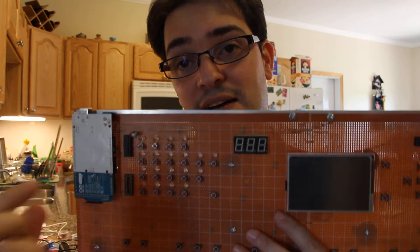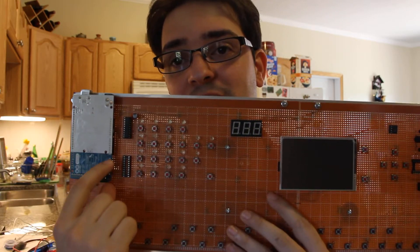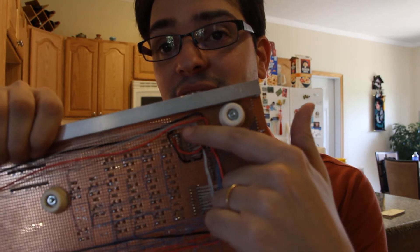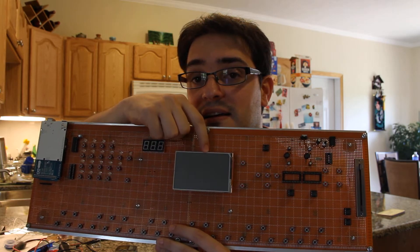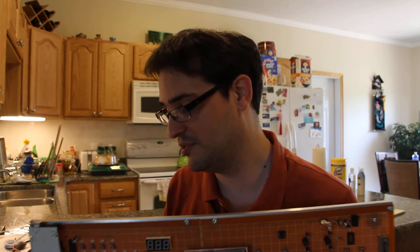I removed the unpowered chip and boom — graphics beautiful, everything working. I picked that chip back up and put it in the top slot that has the wire hookups with the capacitor, and no problem, works fine. The unpowered chip was distorting the data lines communicating with the TFT, giving corrupted graphics. That problem is now fixed.